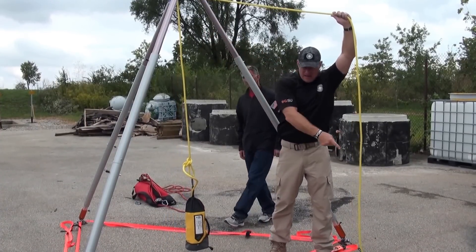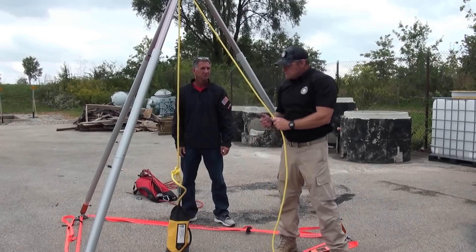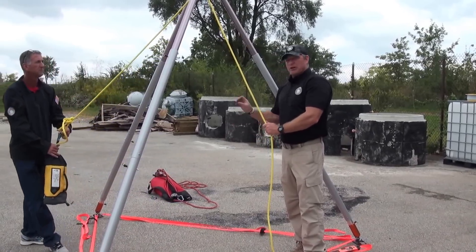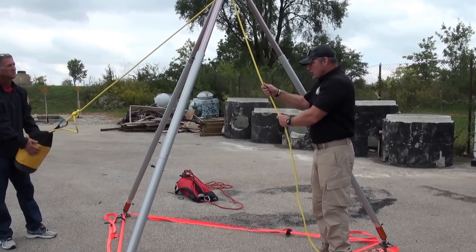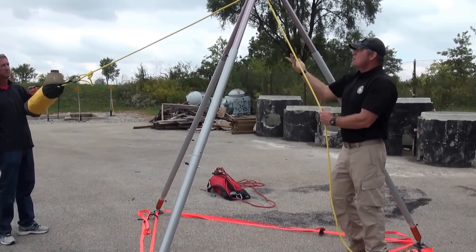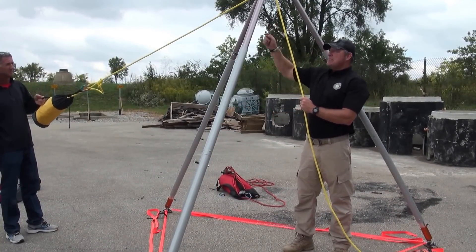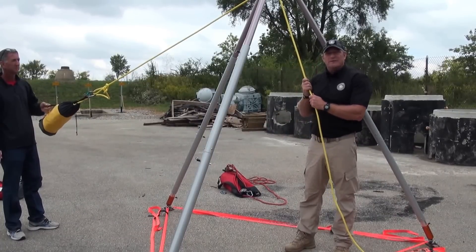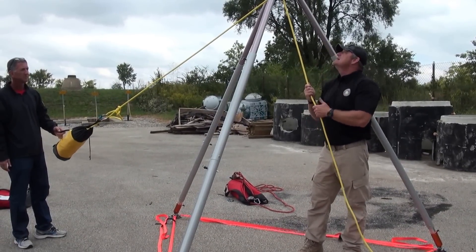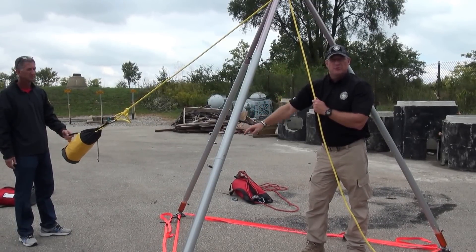If I want that point and that line to work their way back into the footprint, I need to close this angle up. Conversely, the load can be the problem. I may still be hauling up close to this point, but if we've got an entry point that's outside of the footprint, even though I'm hauling and lowering from here, we've opened that angle up again. As the load pulls on that line, we've got to find the resultant coming out of that — now we're shifting that to the front side. Anytime these resultant forces exit the perimeter of the footprint, we're going to have to apply resistant forces — tensioning back ties, adjustable back ties — things that resist or oppose that force and that point we're creating with the resultant force.